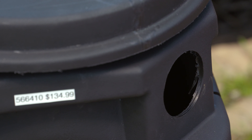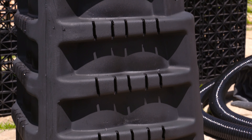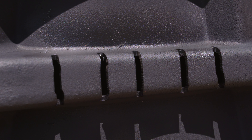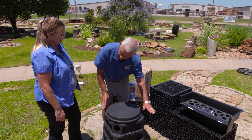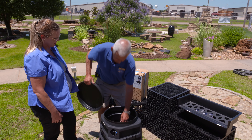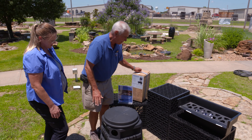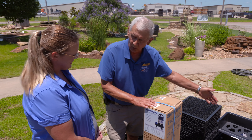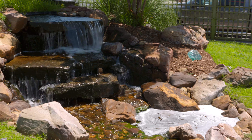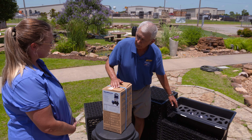The next item we put in the hole is the pump vault, which is really nothing more than a manhole. We're going to set a pump down in here and hook the pump up through this hole down to the pipe up to the waterfall. The water comes in through these slits in the side and fills this up, keeping the pump covered. That's why we've got to have three times as much water. This sits next to the boxes down in the basin at the bottom. If I have to service or replace my pump, I can scrape those rocks aside, take the lid off, and reach my pump to do service work on it.